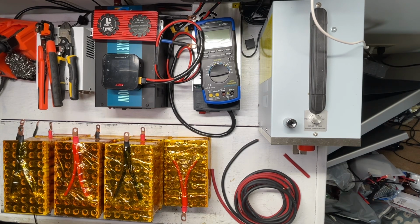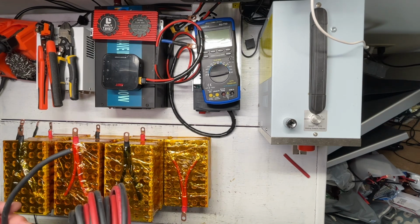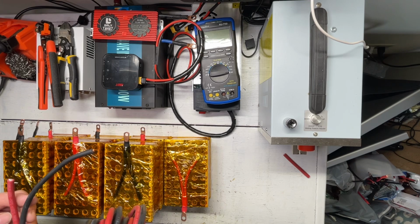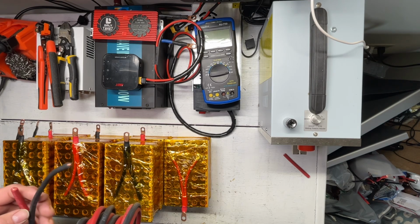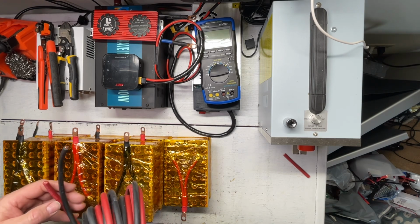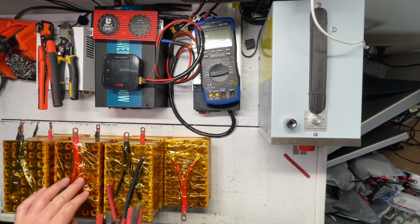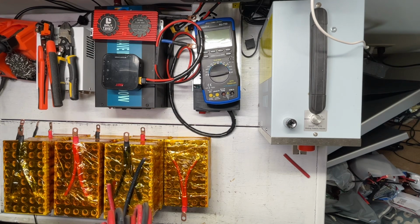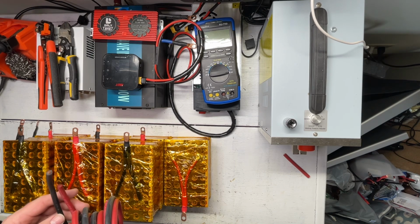And to make all our connections today, we are using this 8-gauge Windy Nation wire, dual listed. You can pick it up on Amazon. As I was stating earlier, one of the most expensive things is good quality wire. The reason I'm using 8-gauge is because I have two 10-gauge wires coming off the batteries. Each of these is rated for 20 amps, that gives us 40 amps capacity, and this also is 40 amps. So we have more than enough.